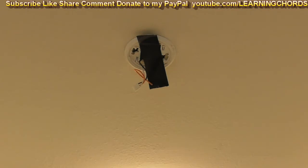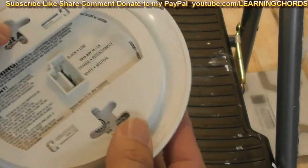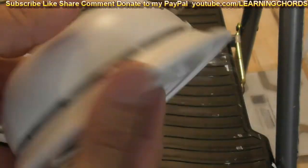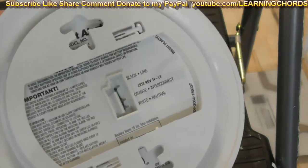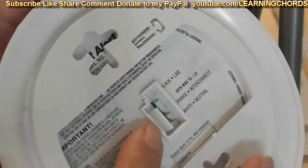You can see the connector up there. Chances are the base that this screws onto is going to be the same. If you buy the BRK model it might be the same or it might not. If it isn't, you'll unscrew the two screws that are up there — this is held on by a couple of screws, it just spins on. Loosen the screws, change the base, tighten it down. Make sure you disconnect the power — shut off the circuit breaker — just to be careful, even if you're just plugging this thing in.